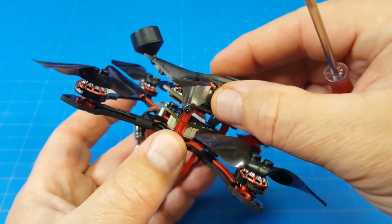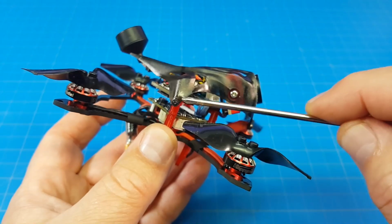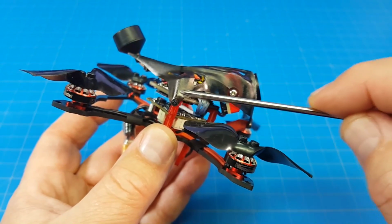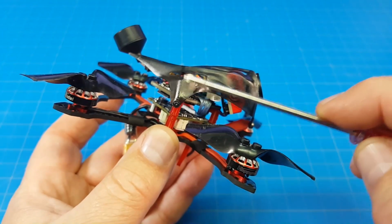I did also find a canopy that wasn't beat up because I didn't want these holes reamed out. This canopy itself is at fault for getting reamed out in this area. There needs to be a little bit more material around here. Even though I haven't broken the canopy in this area, I've seen pictures where others have. That's not necessarily about the frame, but just additional build detail that you should know about.